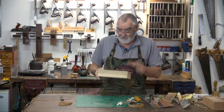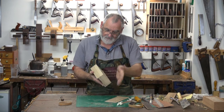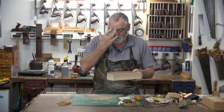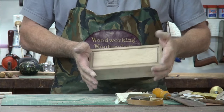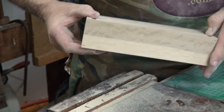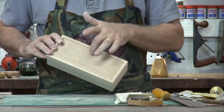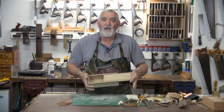And there it is. Now, just to finish it off, pop it back in the vise, give it a nice sand all the way around, knock off the edges, clean up the bottom. Once you've done that, the bottom's nice and clean, all the sharp edges are taken out. Put the two of them together and see how it looks. You can actually see it's got keys all the way around, nice joins at the top, and it's quite presentable on the inside. And don't forget, there's a raised panel on the bottom, which is also a floating panel. So that's it. Another one down.